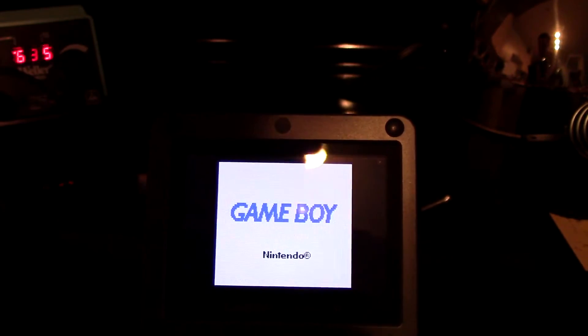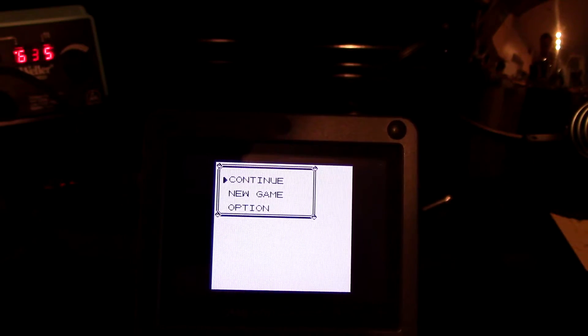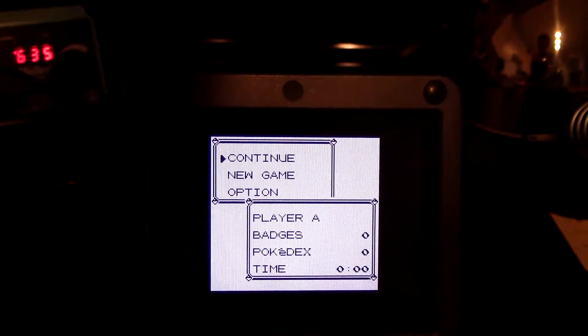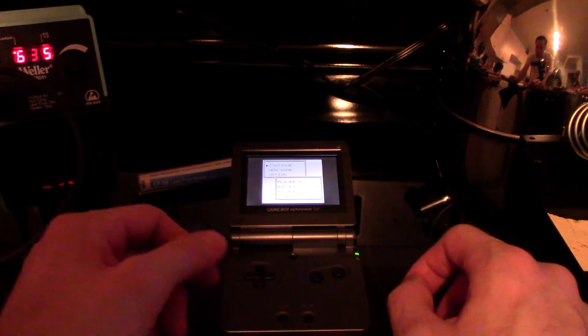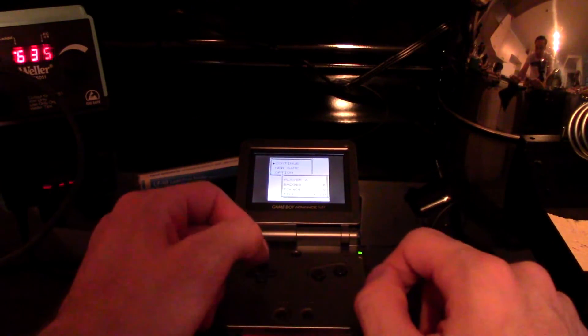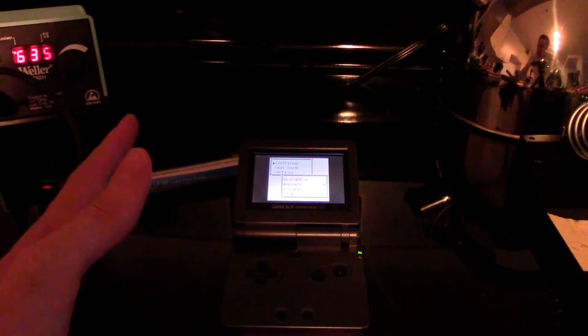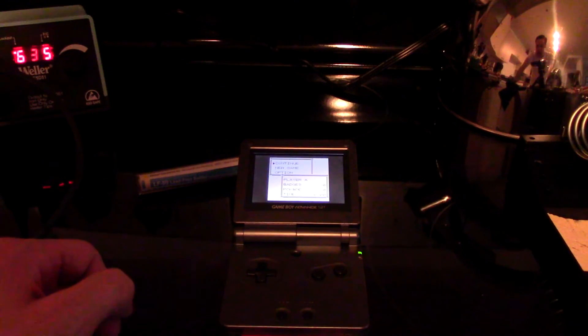Save game — okay. Close. If it says 'continue' we're in business. And it says 'continue' — can you see that? So that's it guys. That's the way you change the battery on a Game Boy Advance game, and this technique actually works for absolutely all the old NES games, SNES games, anything like that. You saw how easy it is — simply two little solder points, you just melt them down a tad, remove the battery, slide in another battery, and you're good to go. Any questions — specifics like the bit you need and the battery will be in the description. I hope you found this informative and I'll see you all in the next video.